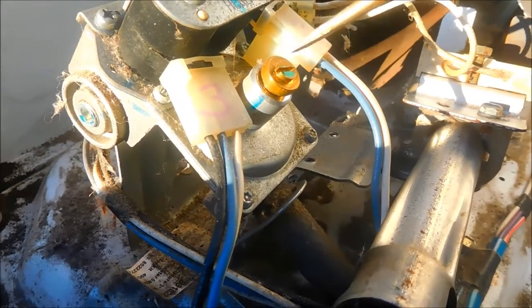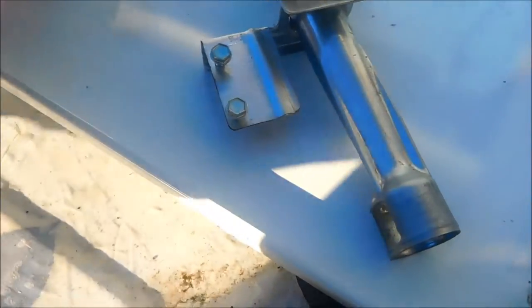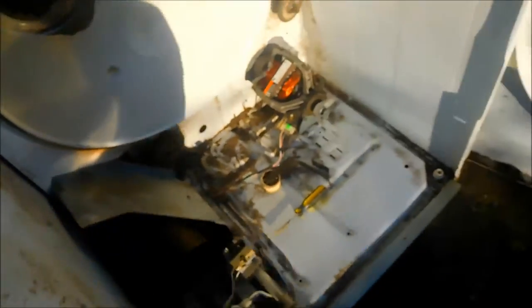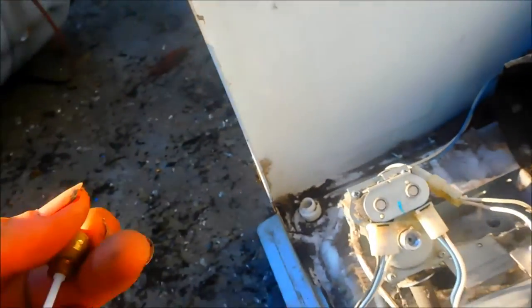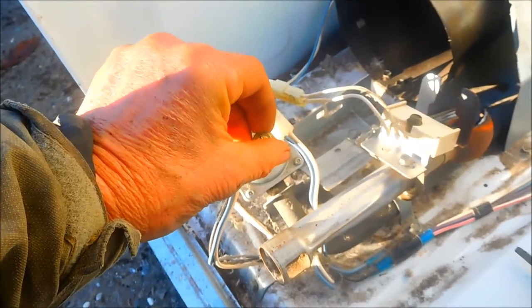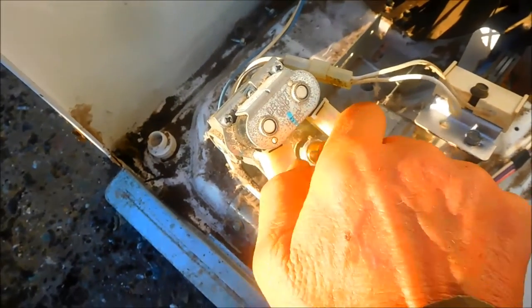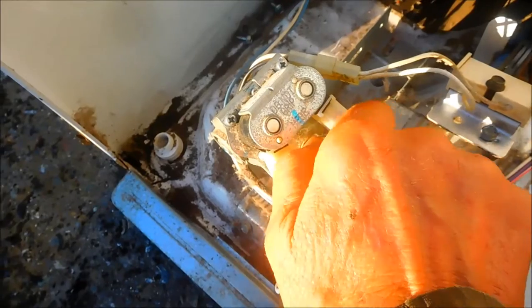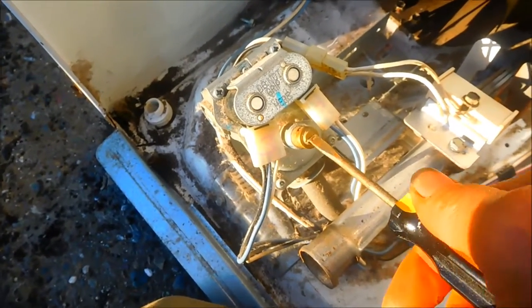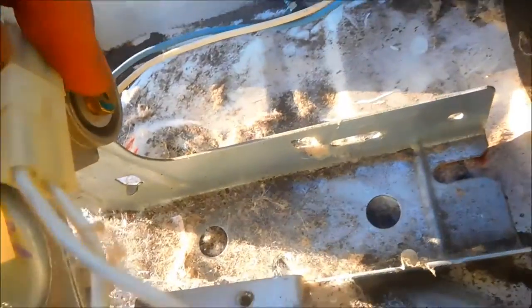Your model may be a little bit different, but this is the typical Whirlpool design. Then we'll grab the other components and swap them. You'll notice this one has a long kind of stem — this is the propane one. It just goes in there like that, and then the new jet goes in here.